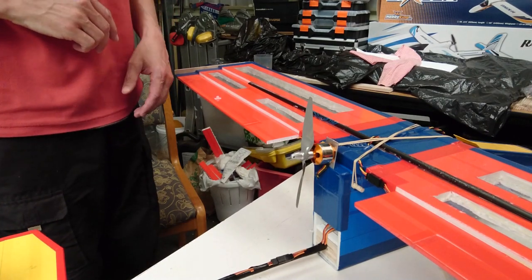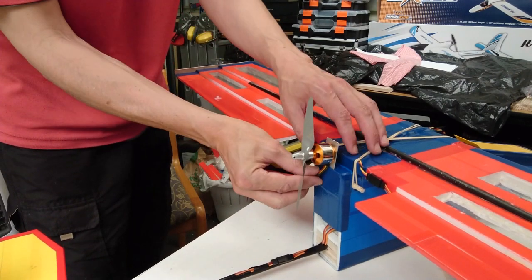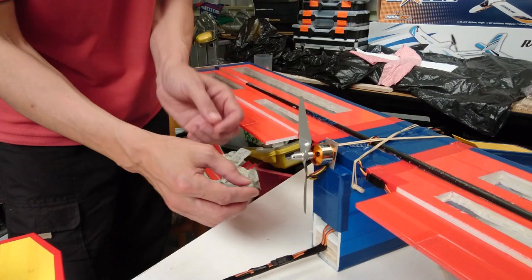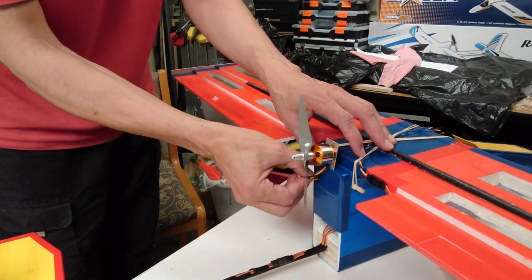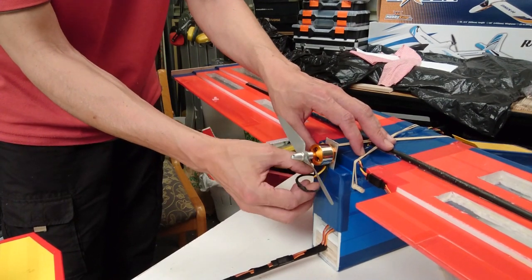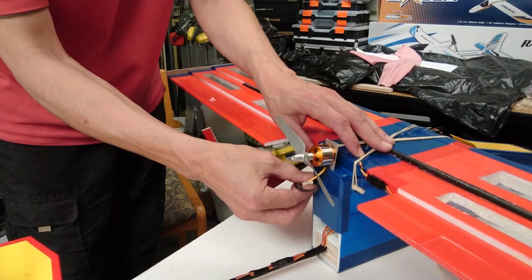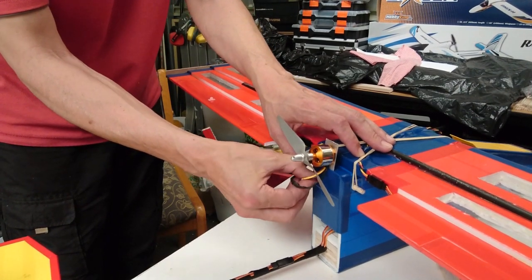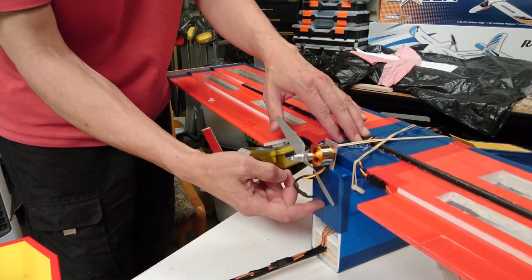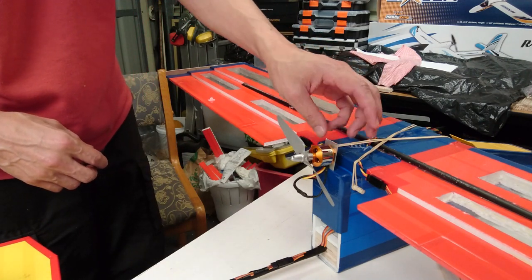Here I'm going to show you how the adjustable removable motor mount works. I used three layers of gift cards to achieve this, with a slot or cutout in the middle, equivalent to the width of the flat aluminium piece that I used to create the motor mount itself. I sandwiched those three gift cards together with Gorilla Glue. I found hot glue didn't really do the job properly. And then I slide that aluminium piece into position with a degree of force.